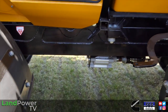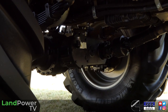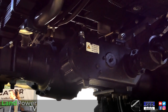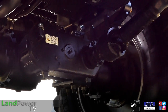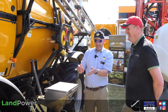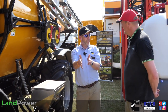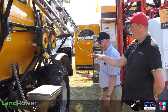On the front there's also a little offset gearbox. The transfer box sits where the shaft drive coming down would actually go through the Cummins engine if it went straight, so you have to divert it. OMSI were really good working with us on this project — they built a custom-made offset gearbox to get around it. All OMSI axles.